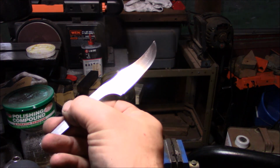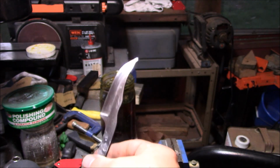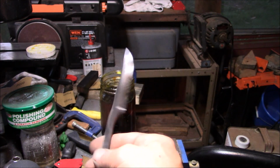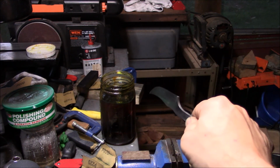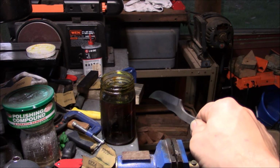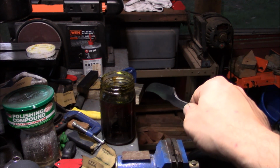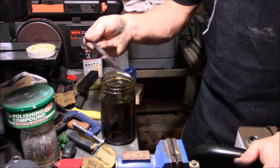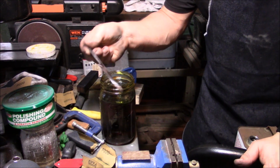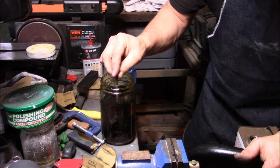the blade. Problem is, I only used 500 grit this time like I did for the test etch. Went back to the old tried and true etchant, which is basically a 3-to-1 water to ferric chloride. Oh, I'm almost scared now. That was a lot of work trying to get that stuff back out of there. I'm gonna watch this like a hawk.